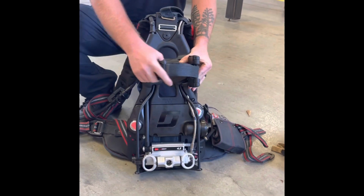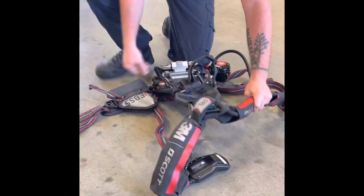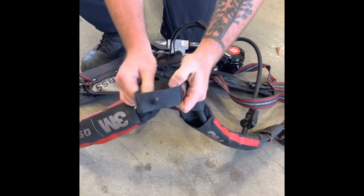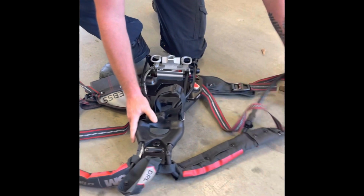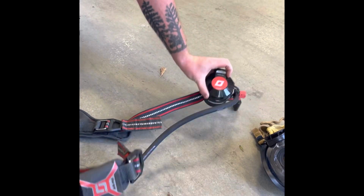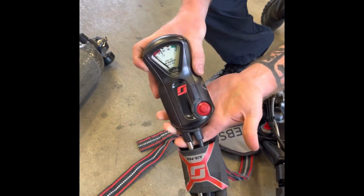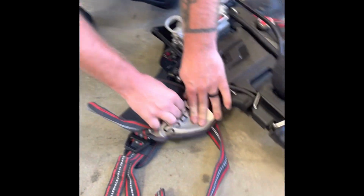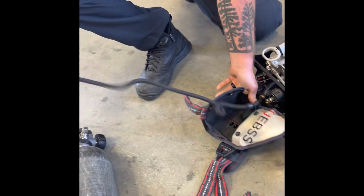Come up to your bottle strap with a clasp. Turn it around. Get here to our DRL, drag rescue loop. Has 2 snaps, snap together. Snaps back inside the strap. We come down our left shoulder strap, have our second stage regulator. Come back over to our right shoulder strap with our air gauge and our pass. And we'll come back down to our buddy breather, which you open and you pull out.